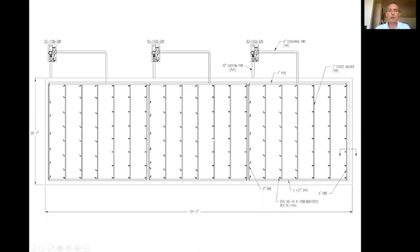For large sumps — in this case 121 feet by 30 feet, typically seen in power industry, cogen plants, and hospitals — we would split them up into smaller systems rather than doing one large system. Again, one GPM per square foot for the filter pump flow rate. In this case we're flowing about 3,000 GPM for the overall square footage of this particular basin, and then we lay out pipe sizes and contractor installation guidance.